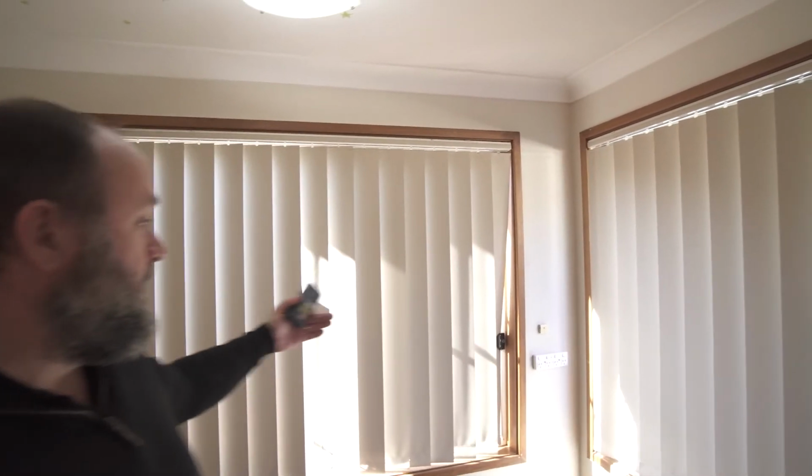Okay, so the first thing I generally do when I'm measuring a floor plan is find one of the back corner rooms of the property that I can start at. I work from the back towards the front, and I try to find a corner which has a shared side wall and a shared back wall. It's important to have that shared side wall and back wall, so you've got a reference point to work off in order to build that floor plan as you go through. All right, got my measure.